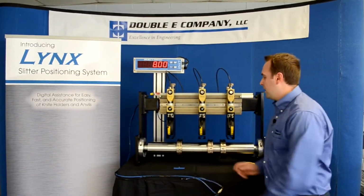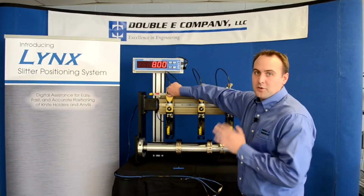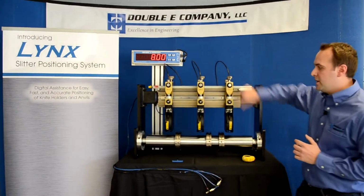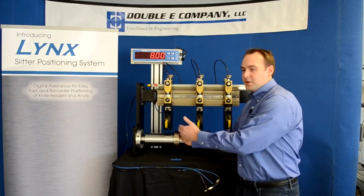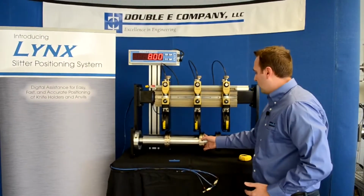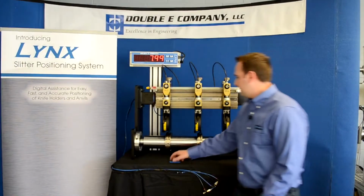system. To position the bottom group, you use our half stroke feature on the gold holder while placing them each to the yellow position. This will descend the knife and bring it over half its approach, allowing you to set the bottom knife to the top knife. Simply sliding over until they touch will position each group with the proper side pressure.